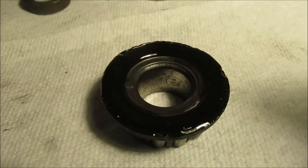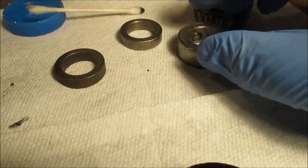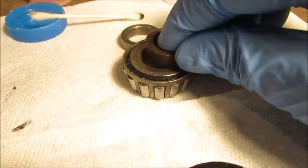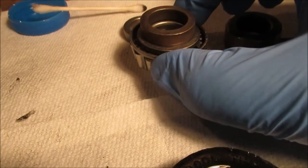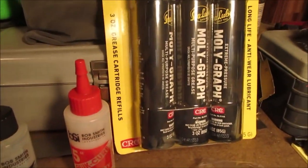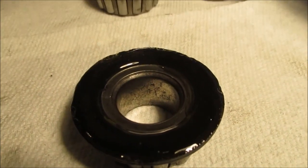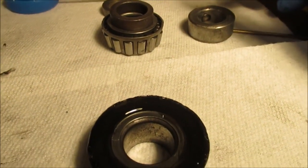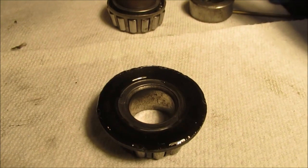The collars are steel — not rubber. So the assembly order is: you put the bearing on, then go up the front, you do the same thing — put the bearing in, put the collar on, and then put the lock collar on, in that order. That's the molly graphite grease. We're gonna fill the bearings up with it — it looked like the same kind of grease that was in it. But I like to use the red waterproof tacky grease — I like the Mobil orange silicone synthetic grease — but another time, another day, another place.